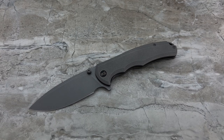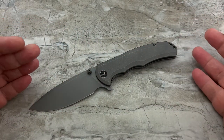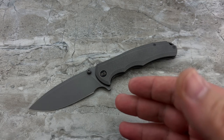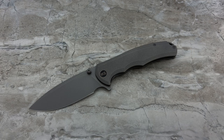They're also running this at 59 to 61 on the Rockwell Scale of Hardness, and I'm not crazy about that — it's a very large gap. I'd rather see 59 to 60 or 60 to 61. When you jump from 59 to 61, the properties are tremendously different. And remember, you're getting that average across batches, not each individual blade — so out of maybe 500 knives, yours might be 61, which would be very good on wear resistance. I just don't like seeing such a large variance listed.